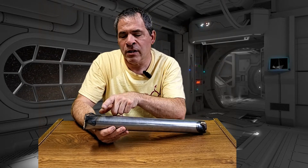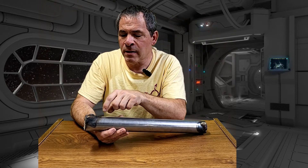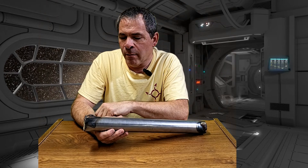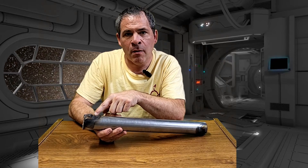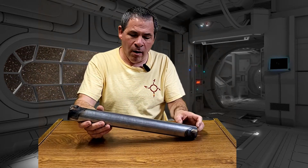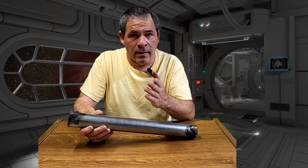The other possibility is that it's the smoke element that's giving us some trouble here. This is the first motor I've designed that has a smoke element — it's basically an epoxy potassium nitrate mixture that burns really hot but really slow, and that produces a smoke trail behind the rocket for probably about 10 seconds after the fuel is depleted. It just makes it easier to track the rocket in the sky. But the smoke element could be the cause of our problem, and we are blowing out in the area around the smoke element. So I'm thinking about doing a Frankenmonkey 3 and simply removing the smoke element, so we have a more traditional rocket motor style — just a nozzle, the fuel, and the bulkhead. I think that would be a good test, because if the smoke element is the problem, that's going to tell us right away.